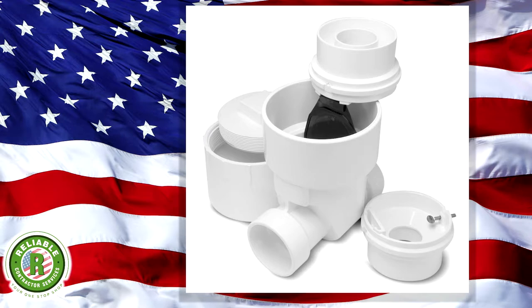How do I know if I have a backwater valve in my home? The easiest way is if you have a plumber familiar with your facility. You can also look around the yard — you'll generally see a large cap, a green or white cap. Most caps are six inch on a regular clean out on a house, but on a backwater valve they're going to be eight inch. So it's really evident for a plumber or contractor — if he sees an eight inch pipe, it's probably going to be a backwater valve. If you see a four inch or a six inch cap, it's probably going to be a clean out.